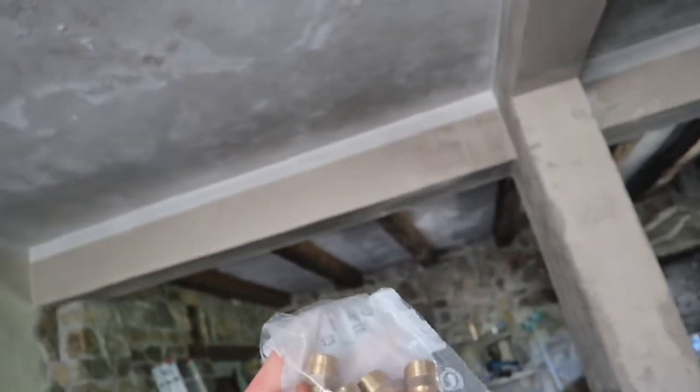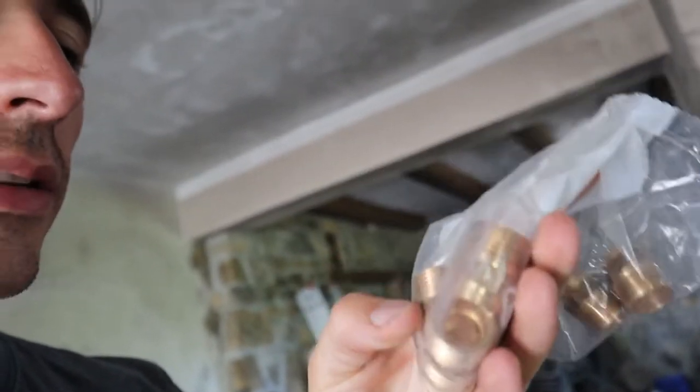On the other side are lockshield valves. I'll wrap these now in a clockwise fashion. Once that's done I'll put all the valves on and start dropping the pipes. Unfortunately in Croatia they don't have a normal pipe union where you can just compression-joint the pipe on — they are female joints onto the radiator valve, so I've had to buy separate connectors. I can solder into one end and the other end is threaded. It's a pain but there's no other option here.